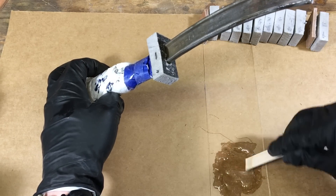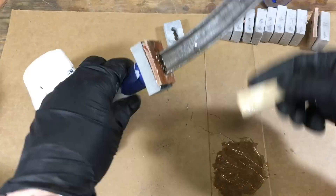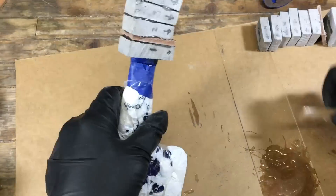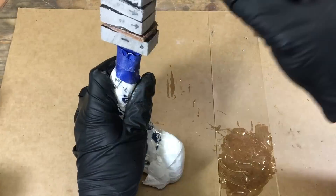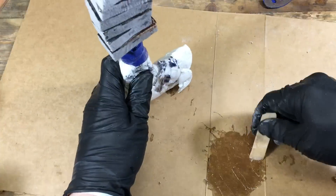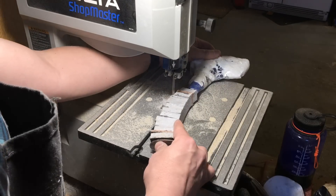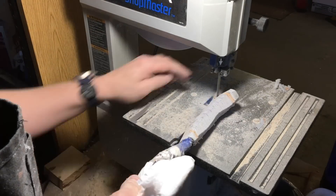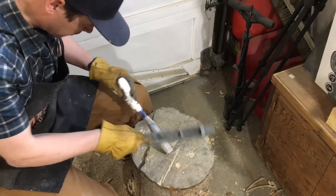I tried not to do too much epoxy around the handle itself — I wanted it to have some give and take. There's a lot said in comments that with a micarta handle it won't be as comfortable as the leather, and I probably agree with that, but it would be interesting to test. I let it sit after gluing, gave it another hour, then took it to the bandsaw to begin the initial shaping and used my rasps to shape it further.